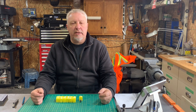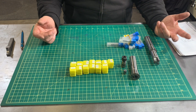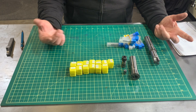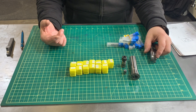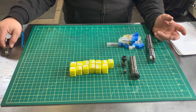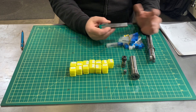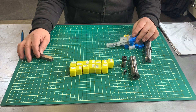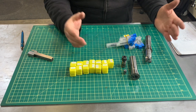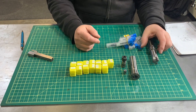Let's get in with the camera and see how we can circumvent the extra costs associated with the conversion. We're having to use some metric end mills to mill some contours or drill, for example this cutoff tool — the measurements are metric in here, so to do a good job you really need to use metric end mills. If you don't have the tools, how do you get around all this? Do you buy a whole bunch of collets?